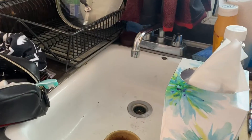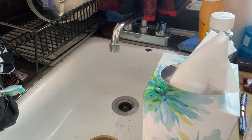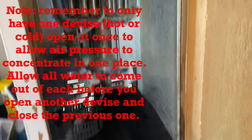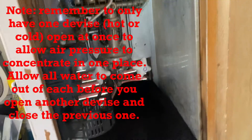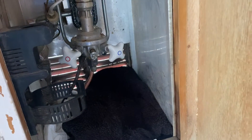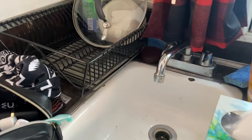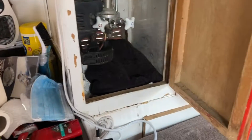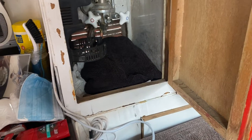You can hear some noises, so air is coming out — these things are open. It looks like most of the water might be drained already. This is the water heater — we're opening it up so that stuff is drained. You can see some water dripping out of there. No water coming out yet from here; if we close this, that's going to build pressure. This is still dripping. And then we have the shower — we're going to open this up.